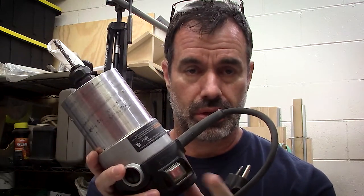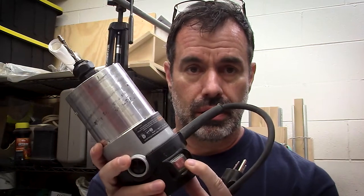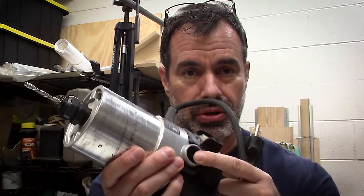So be sure that if you are using an external switch of any sort, you still use the on/off switch on the device whenever it's not in use. When I am using the router regularly and I'm not changing bits I'll use the foot switch, but if I change a bit I will also turn it off.